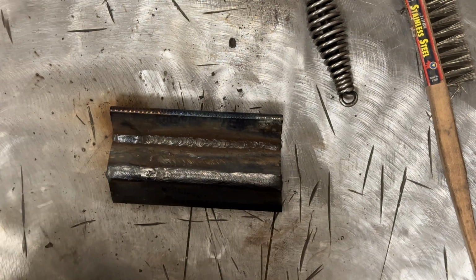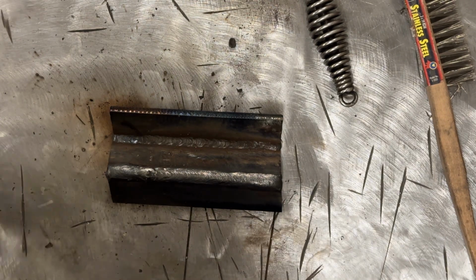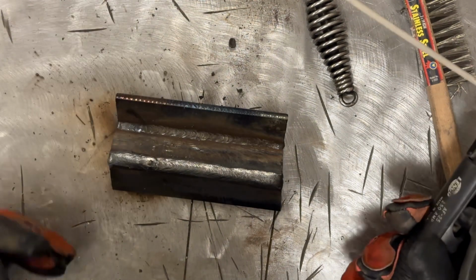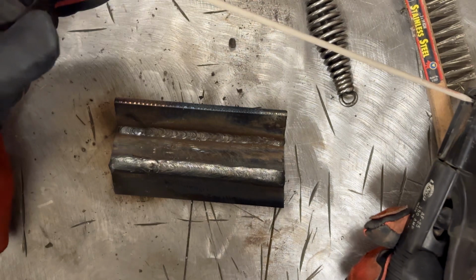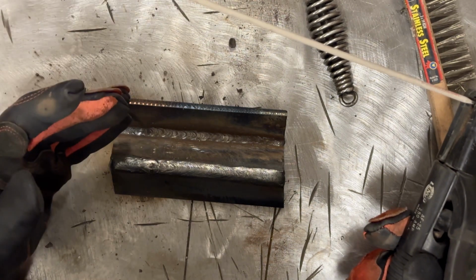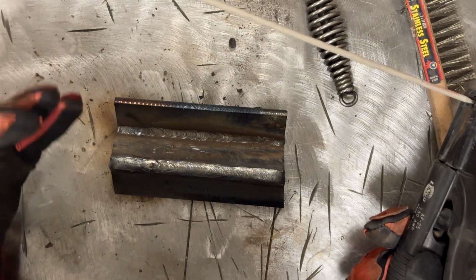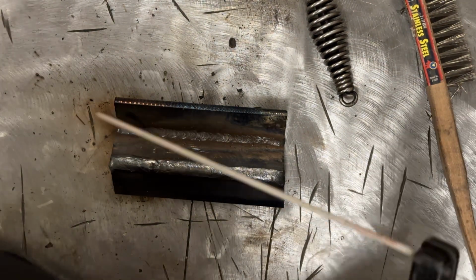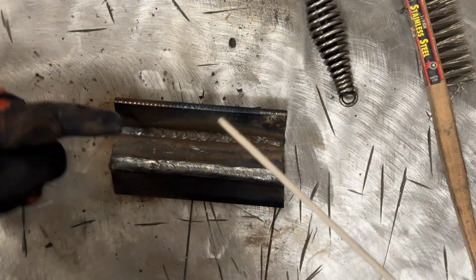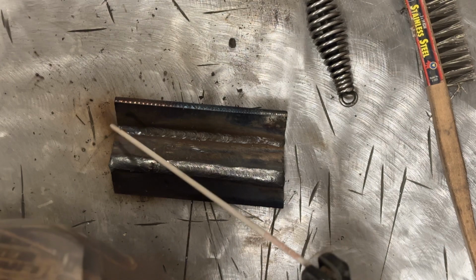Yeah, let me get this chuck back up and we will weld this. Now it's important, use all of your rod. Don't do this as a, hey, I'm going to use a brand new rod for every pass. Real life has restarts. Don't be afraid of them. You know, you want to practice those. I'm going to start by welding the one over furthest from me.